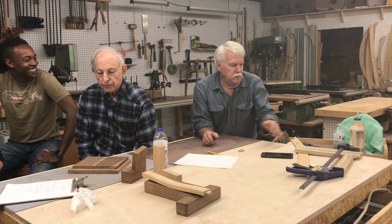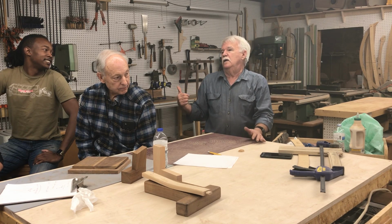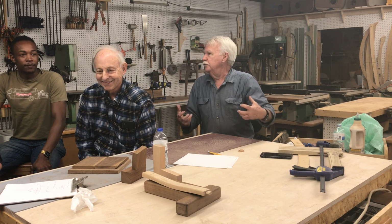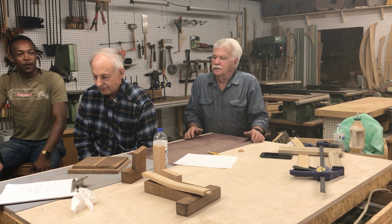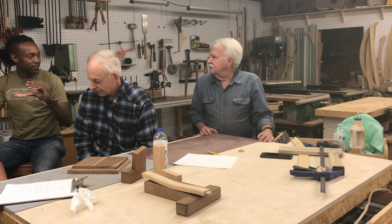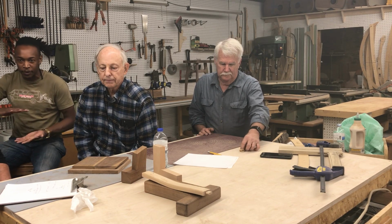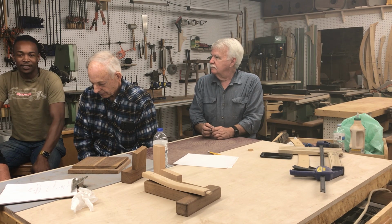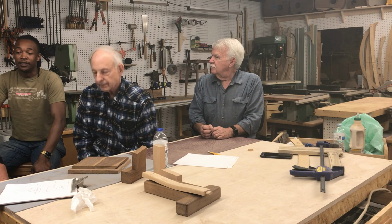To me, this is a big piece of wood, right? The stuff that Joan has been doing takes a little lift and 3 guys to move it. Some 500-pound slabs, making some really cool stuff. They're cut over 4 inches thick, so when they dry, they're closer to 3, and then still have a lot of material to grind away to get them perfectly flat, and then find some wet spots and let them dry some more. So it's an adventure. It's a lot more time consuming than buying dimensional wood. Yeah, a whole lot more.